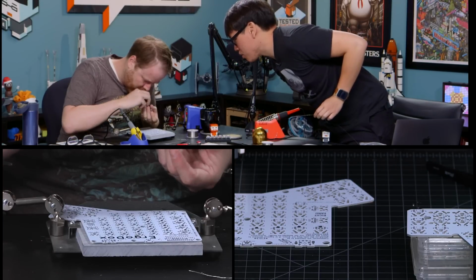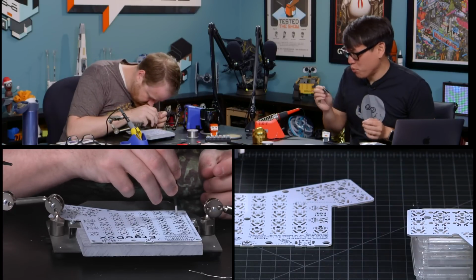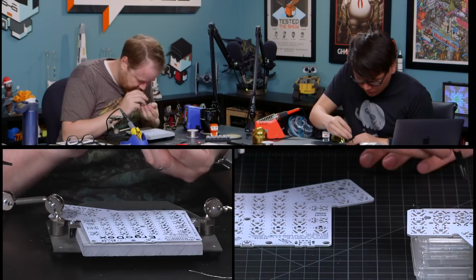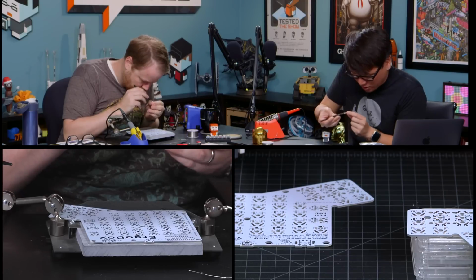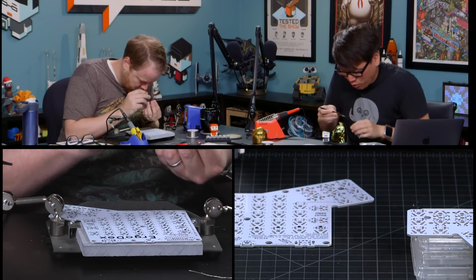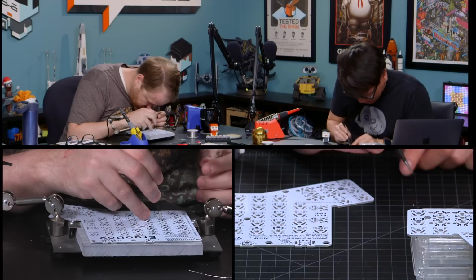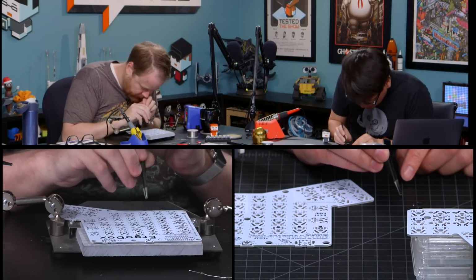So wait, have you soldered? I haven't put anything on yet. I'm going to see what your solder looks like. I don't think we should put too many on. Well, why not? We have to do them all or else it's not going to work. I know, but I say we should start actually soldering because with too many on, they'll shuffle off with any movement. Oh, that's possible. So I'd say just put 4 or 5 on in place and then solder 5 at a time. Well, now that I have them all here, though, oh, hell.